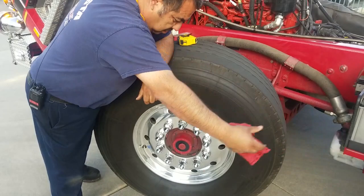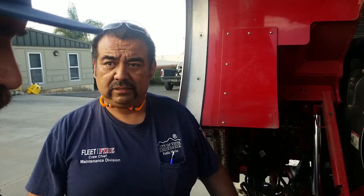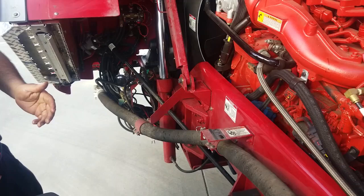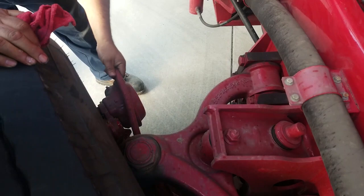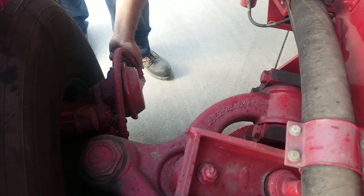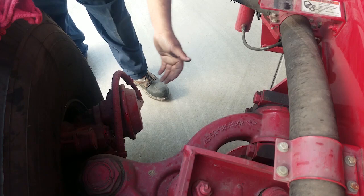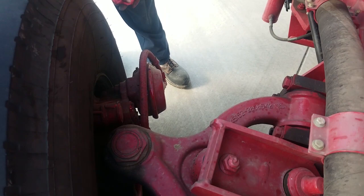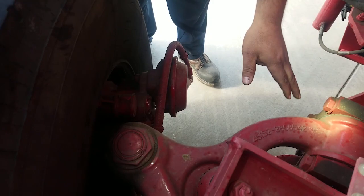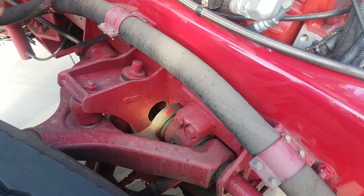From the tire, carry on to the inside and start looking at the suspension — whether it's a spring, leaf spring, or straight axle. You can see it, put your hands on it, inspect it. Check hoses physically — put your hands on them and check for cracking or looseness. Anything that's swiveling shouldn't be moving. Make sure your caliper is there, not falling off the bolts — look for indications of looseness. Rust that's been spray-painted over is a good indicator of previous issues. Look at the arm or spring or axle for indications of looseness. Look at the bracketry — make sure everything looks okay, nothing cracking. If you suddenly see fresh paint flickering off, usually something is moving.